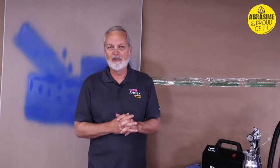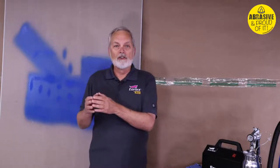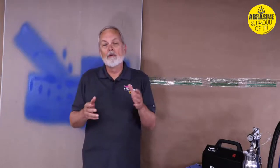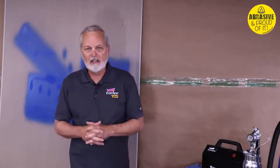My suggestion: make it easier on yourself and buy polyurethane paint so you don't have to add a second layer. The more different chemicals you put into your finishing projects, the more likely you'll have an issue — not all finishes are meant to work together, and competing brands aren't expected to be compatible. The fewer different products you use, the easier it'll be. I usually stick with a water-based poly solid color paint, or a stain with a clear poly finish over it — keeps it very simple.